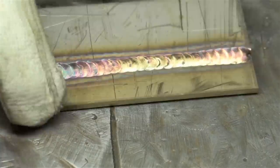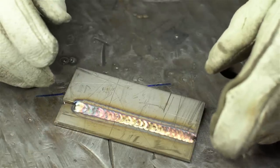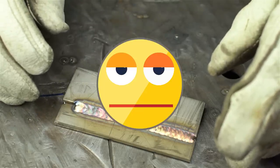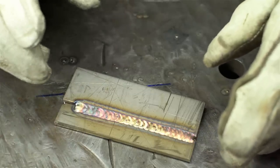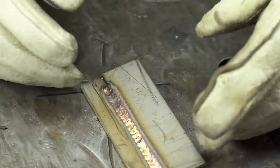Sidebar: if you're just starting out, I think pulse is also a great learning tool. Use it to develop a consistent torch and filler motion — it's sort of a clock you can work to. Set it down low, somewhere around one or less pulses per second, and just use the machine's clock to time your welding. You can't really add too much or too little filler when you have the welder cracking the whip so consistently. Psychologically, it probably also helps to keep your travel speed more uniform. Add filler on the high pulse, scoot ahead a little bit on the low pulse — you could also use the arc downtime to reposition your hand. The more you do that, the more you develop the muscle memory to weld without the pulser.